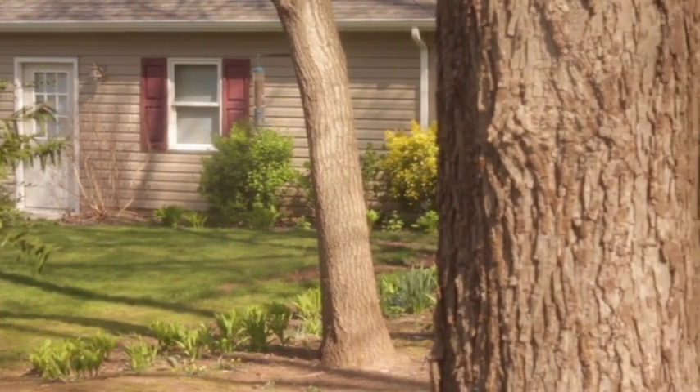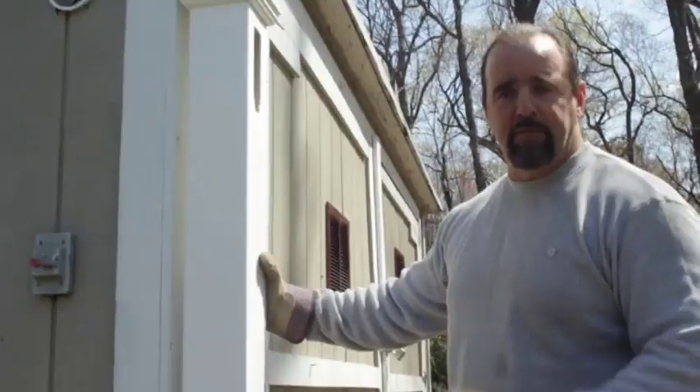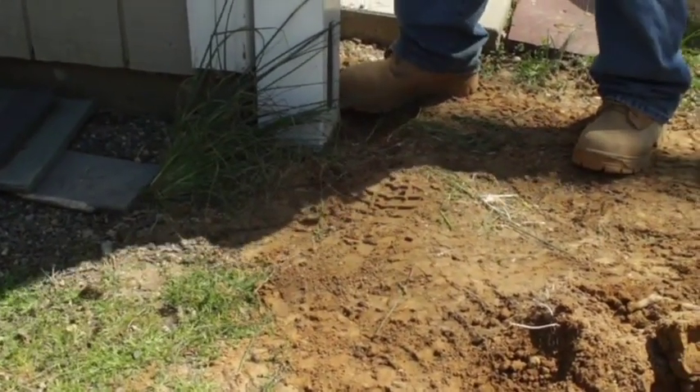I already pre-determined that I was going to use a New England style cap from Boundary Fence. So I installed my post three feet deep, four inches in diameter. I put my post in a hole, put a little dirt in the bottom, the rest of cement, and a little more dirt on top. As you can see, the post is already solid.